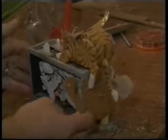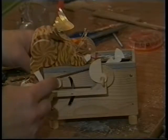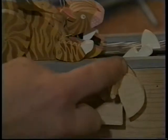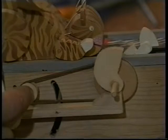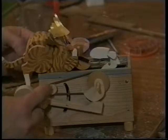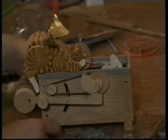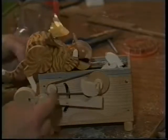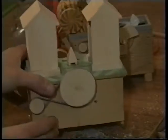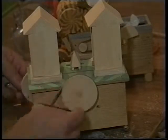The handle on this cat, which is eating fish, connects with a small pulley. This in turn connects to a larger pulley via a spring drive belt. Because this pulley is only half the size of the other one, I have to turn the handle twice to make the larger pulley turn round once. The two pulleys on this cat-eating-fish are both going in the same direction — anti-clockwise. If I want one pulley to go anti-clockwise and the other to go clockwise, then I need to put a twist in the belt. On this one, one pulley goes anti-clockwise and the other goes clockwise.